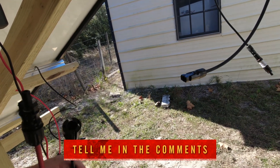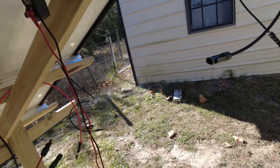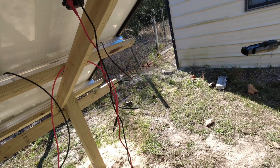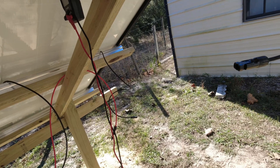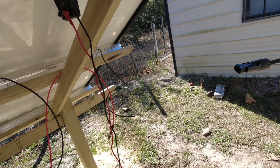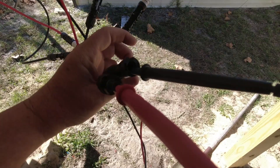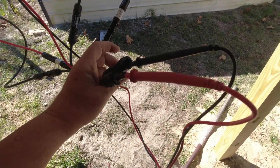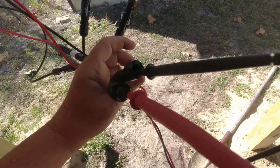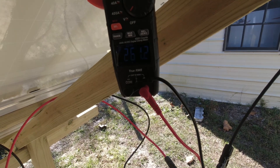We have to be very cautious because the voltage is already high. If you were to create a dead short between positive and negative you would see a pretty good arc, and with the higher amps after paralleling it would arc even more — you could basically weld with it. We'll tuck those away in a minute. After all connections are made, verifying with the meter: DC volts reads 261 — the volts stayed the same, just as expected when paralleling.